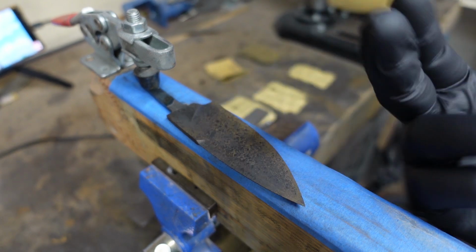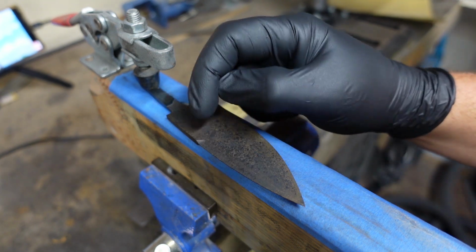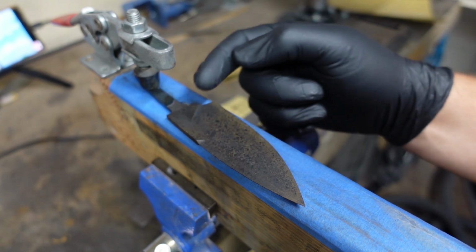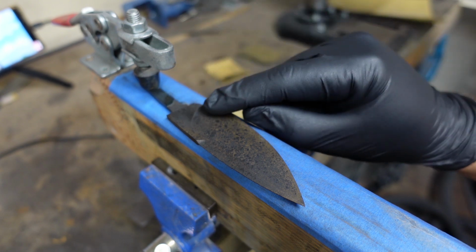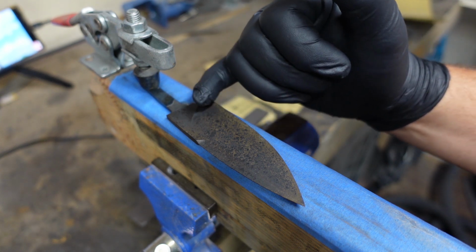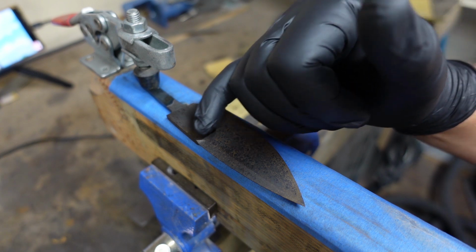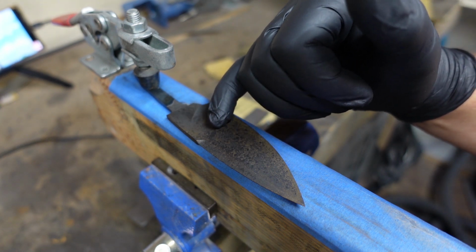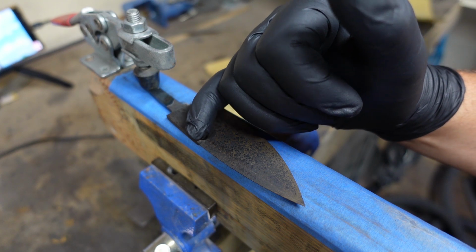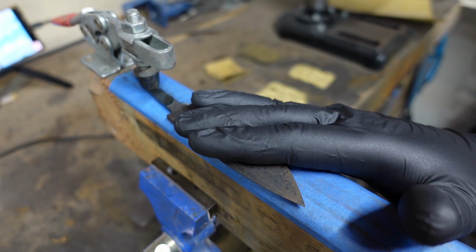and then we're going to sand the actual main bevels. The whole reason behind that is, as you start removing material in different areas, it starts throwing off your lines just a little bit, because we're not going to be removing a ton of material, but we will be removing some. So as we start sanding this area down, it lowers the plunge line area. The plunge line comes up and swoops back at an angle, so as you sand down, that line comes a little bit further forward. Same thing for the line where it transitions from the flats into the bevels. That line starts coming a little bit further down. And then when we start sanding here, it starts going a little bit further up. That type of deal. So for all of these, we want them to work exactly how we ground them.